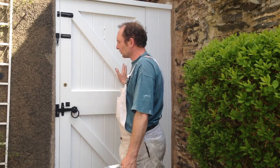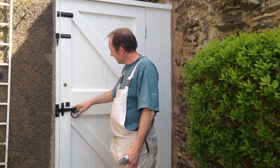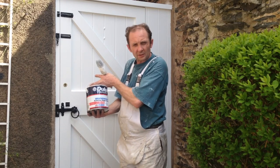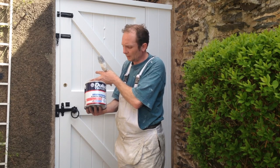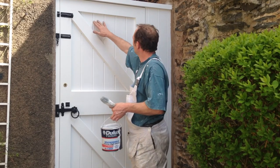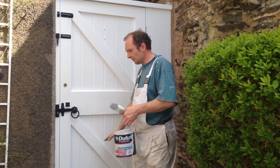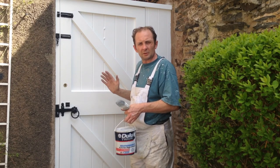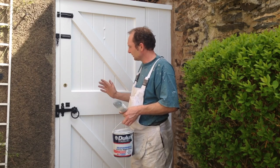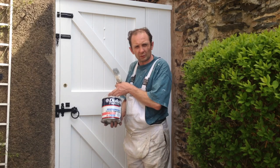I've finished glossing this gate now along the frame surrounding the frame. I've put all the ironmongery back on — that's all been painted both sides, back and front — and it's been glossed in Dulux Trade Weathershield gloss. It's a big must for outside properties. Your routine for glossing: do your inserts, follow down with the centre piece, top and sides, same down the bottom. Glossing is the same principle as your undercoating. Don't forget to check for runs on the gate every 15 to 20 minutes until you're sure it's okay. Dead easy to paint. Your main trade secret is the type of undercoat — Weathershield is what you want.